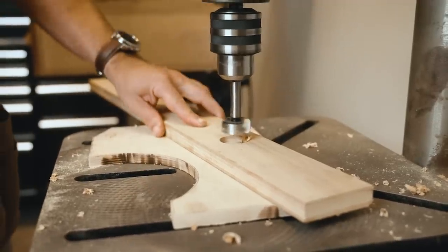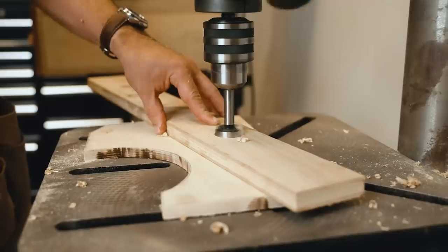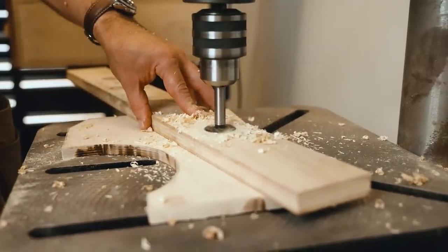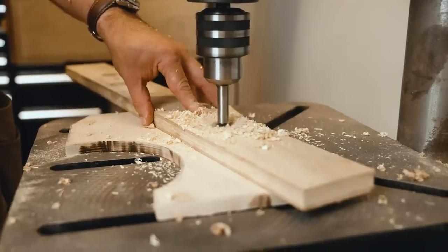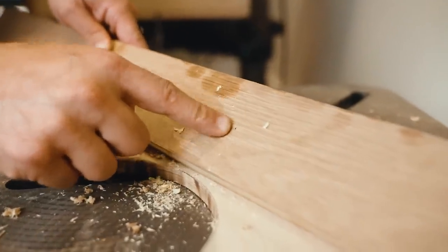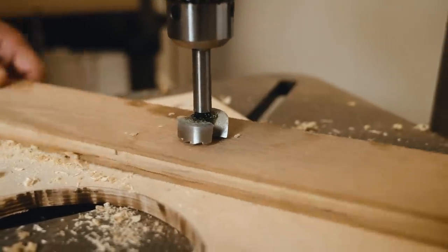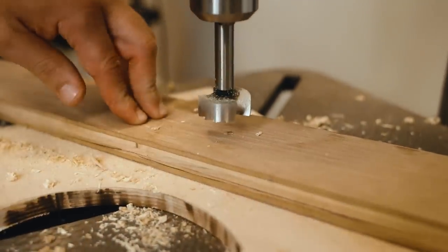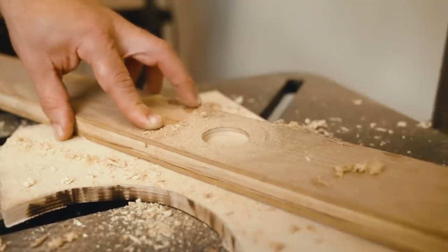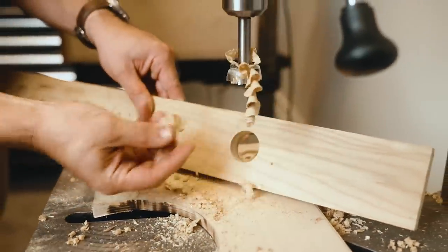If you lose your spot after moving the board, use a loose hand when you get back to the hole and it's going to find its way in, then hold it down. Once you hit your stop, the spur should be right through. See that tiny little hole? That's when you stop. Before turning on the drill press again, place your spur right in that hole — it'll find center — then turn on the drill press and drill right through. Now we've got a perfect hole with no tear out, and beautiful chips.